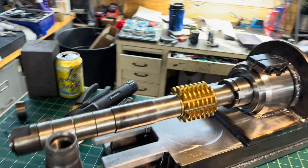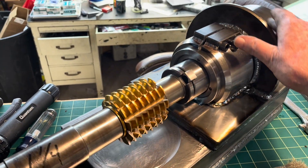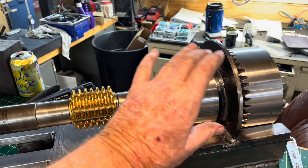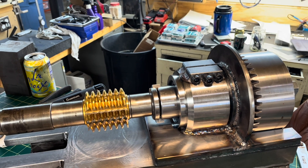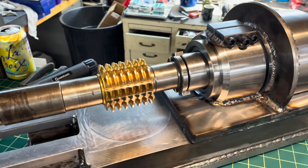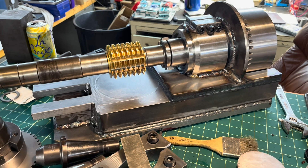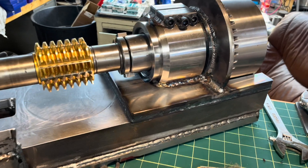I will supplement this with some still photos. You can see the arrangement here of the three cap screws. The one in the middle is a jack screw to jack the bore open, and these two on the outside are clamp screws. That worked just exactly the way it needs to. I have to tell you, the inside bore of that clamp setup there is not the best - it's not something I would hold up as a paragon of good machining - but it's not too bad, and in the end it doesn't really matter because I can't see it.